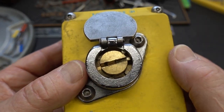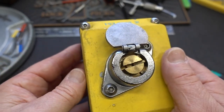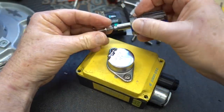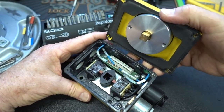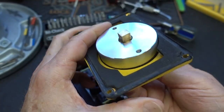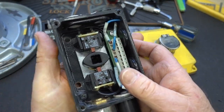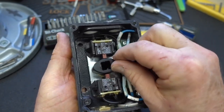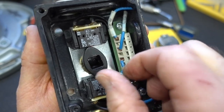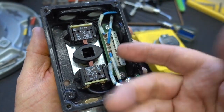Kind of an unusual lock. I appreciate you guys bird-dogging this for me — I never would have found it had you not taken the time to find it and send me the link. Stay safe, stay legal. I knew if I didn't take this apart you guys would be throwing rocks at me. No springs flew out — that's good. We're not going to be taking the lock itself apart; that's a solid aluminum body. It looks like a quarter-inch shaft sticks down into the switch body. When that shaft is in there, it turns this oblong oval piece to activate those switches. When you unlock it, those little plungers come back out and either deactivate or activate the switch.